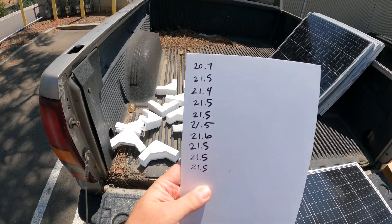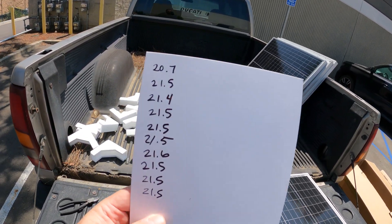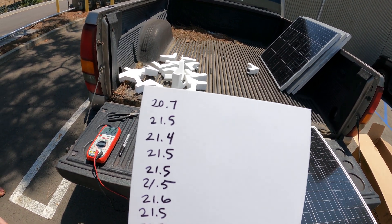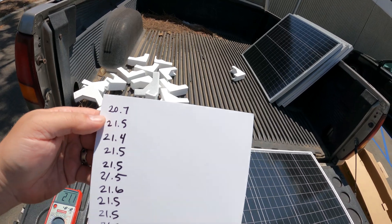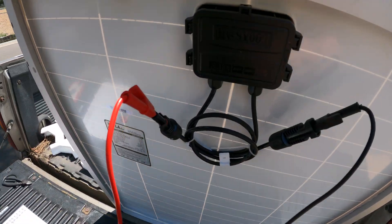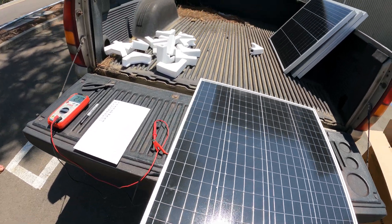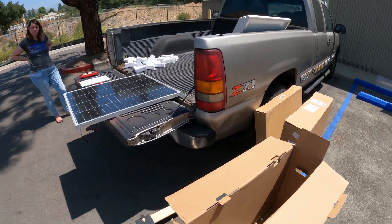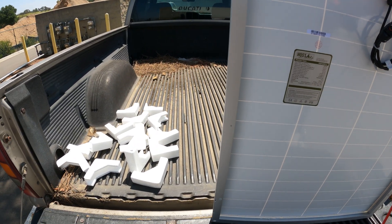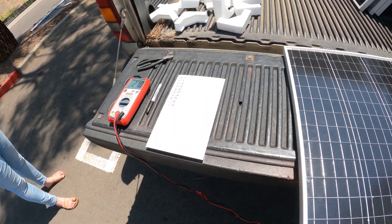As long as they're all in the 20-volt range I'd be pretty good. You don't necessarily need to do this, but I highly recommend it so you know all the panels are working, and it helps with any future troubleshooting. We're done testing them all — the first one was about one volt less, but after we tested it the sun peeked out and got brighter, which is why it's best to do this all at once with no clouds. The quality control was pretty good — HQST says open-circuit voltage should be around 21.6V, and that's what we were finding.